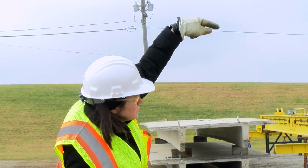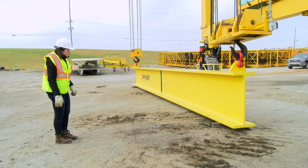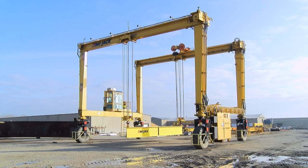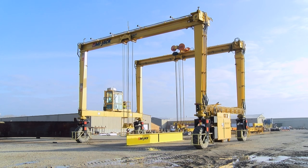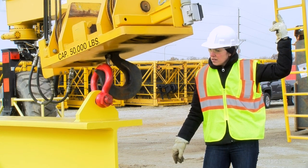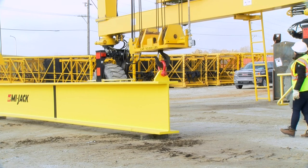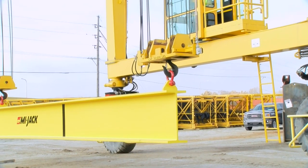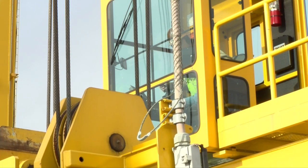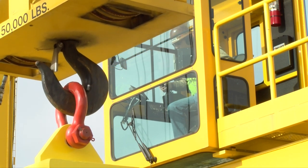Applying all of the principles and procedures covered so far, we will take you through a typical load handling operation of the HD Series crane with a strong back beam. Position the crane over the load so that its weight will be equally distributed between the front and rear top beams. Then traverse the hook block directly over the load in order to prevent any side pull when hoisting. Lower the hook blocks enough to allow the ground crew to hook the load. Hoist up until the hook blocks are nested under the trolley frame; the guide should straddle the trolley but the hook block must not be tight against the trolley, ensuring maximum load stability while traveling and traversing. Then traverse the load to center, move the crane with its load to the appropriate area, stop the crane with the load aligned as much as possible, traverse the trolleys as needed, and finally hoist down until the load is placed properly. When operating using the hook blocks, after attaching the load, follow the same basic procedure.